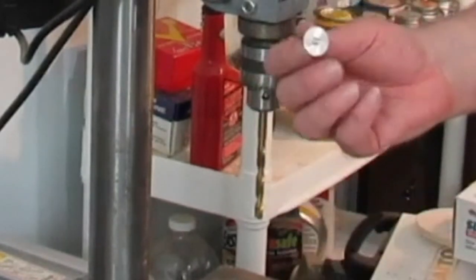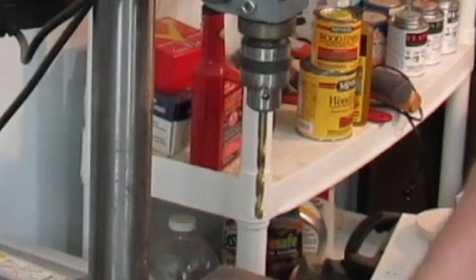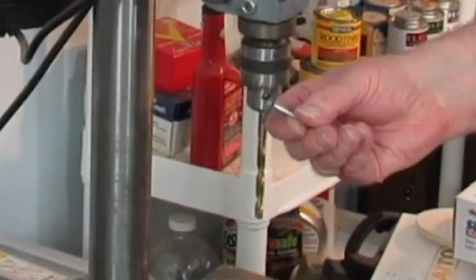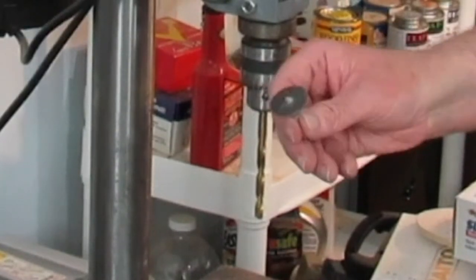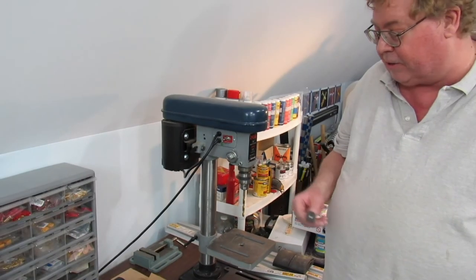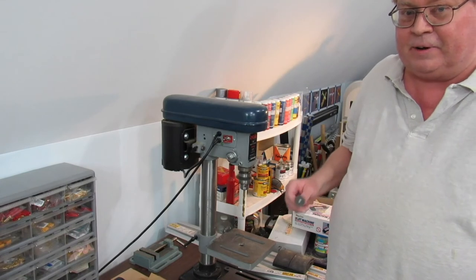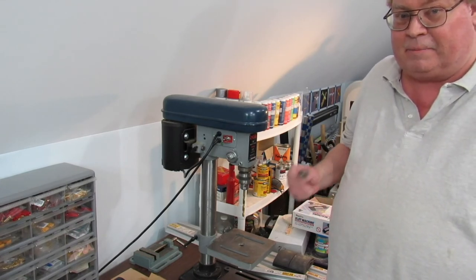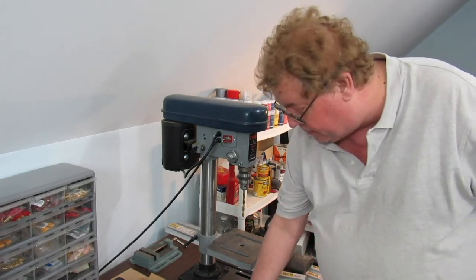He also came up with an X-Acto knife jig that a lot of people copied and don't even know that he created it. You can slot the balsa with a carbide disc, but your slot will be thicker. Because you're filing it down, it really doesn't matter if it's too big anyway. Use epoxy with a light amount of micro balloons or Cab-O-Sil to thicken it up a little bit when you put the plywood in.